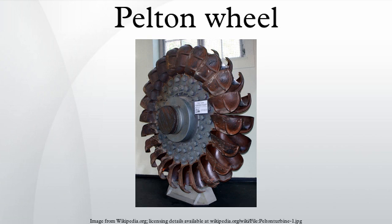System components: The conduit bringing high-pressure water to the impulse wheel is called the penstock. Originally the penstock was the name of the valve, but the term has been extended to include all of the fluid supply hydraulics. Penstock is now used as a general term for a water passage and control that is under pressure, whether it supplies an impulse turbine or not.